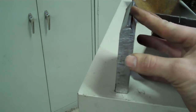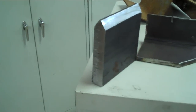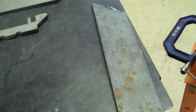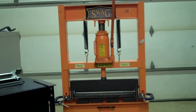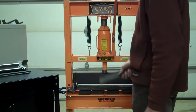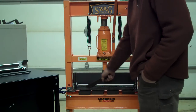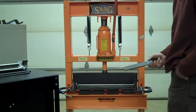Again, it's been machined at a 60-degree angle on the top surface. I'll give you guys a demonstration here — I'll be bending up this piece, just two-inch, quarter-inch thick flat bar. First and foremost, I want to make sure your press brake is completely supported on the bottom surface. You're going to need more than just the two press plates you get when you buy the press.